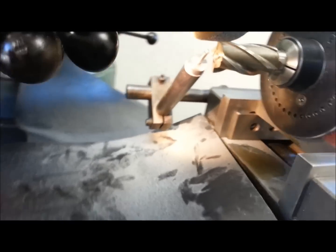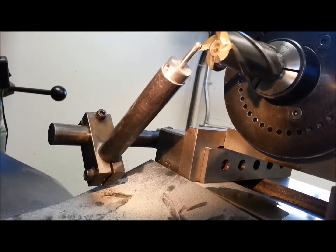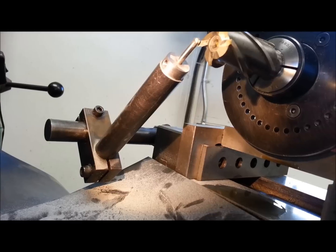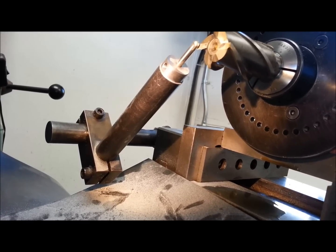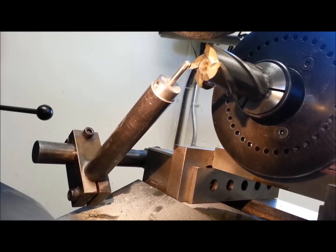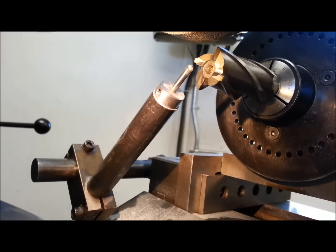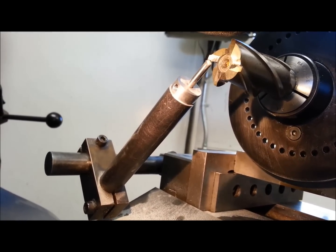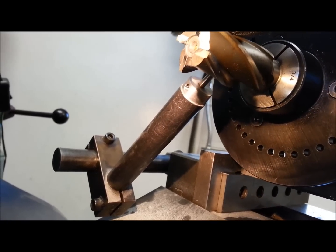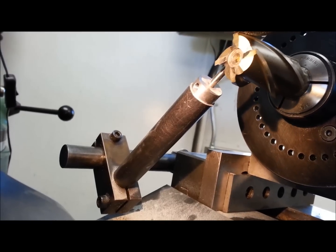I've also made a little probe for my vise — that's just the backside of it, trimmed down on the end and center drilled. It's actually a piece of drill bit that I've cut off and rounded the end of. What that allows me to do is take a mill, index it right on the flute, then give it a slow turn staying in contact with the flute, and it'll follow it all the way in. With the grinding wheel running, I am sharpening end mills.